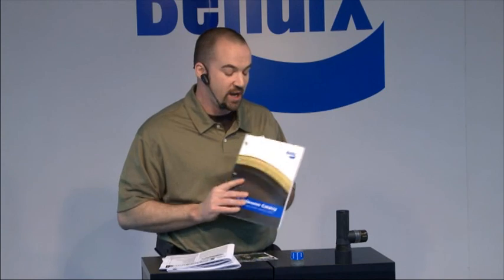I'm Chad — I am 1-800-AIR-BRAKE. If you pick up the phone, dial 1-800-AIR-BRAKE, option 2, option 1, and you'll get the Bendix tech team. There are five of us and we answer phones Monday through Friday. Last year the five of us answered 67,000 phone calls. About 60% of those were ABS calls, and of those about 40% were troubleshooting calls. Out of that 40%, only about 10% were actually bad controllers — everything else is usually a wiring-related issue or a speed sensor fault, something simple like a sensor backing away from the tone ring at the wheel end.